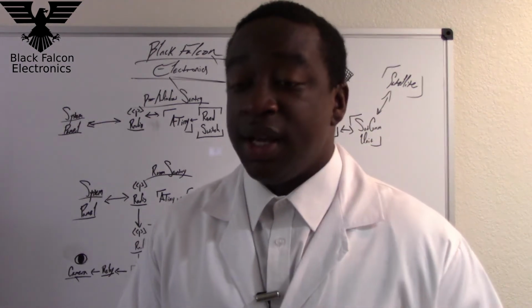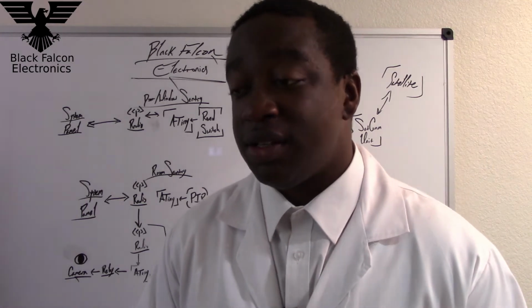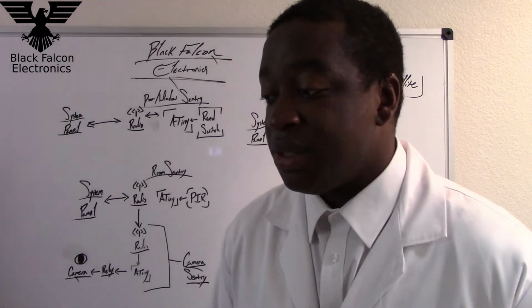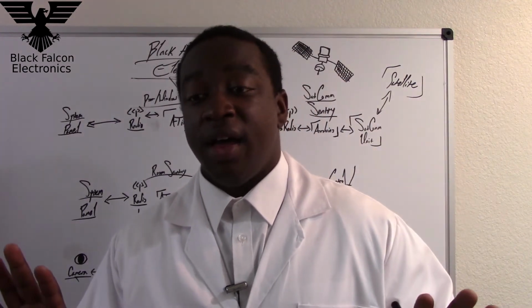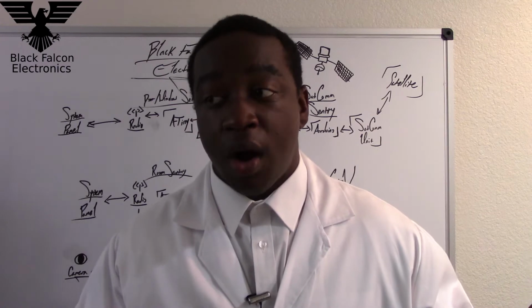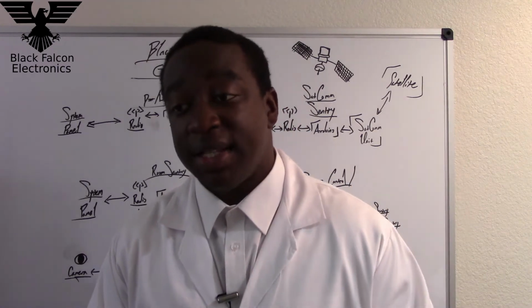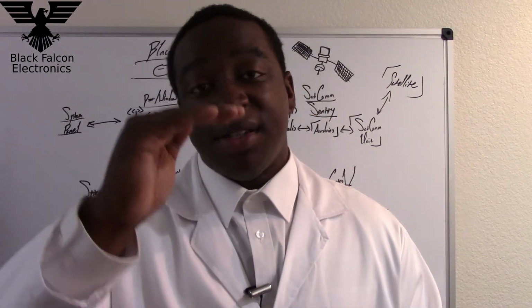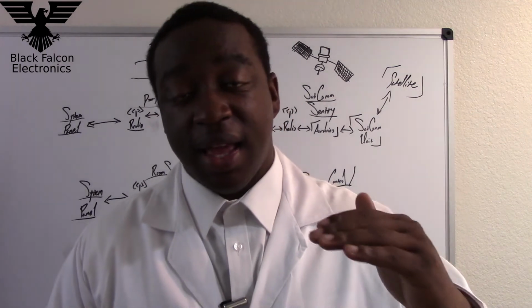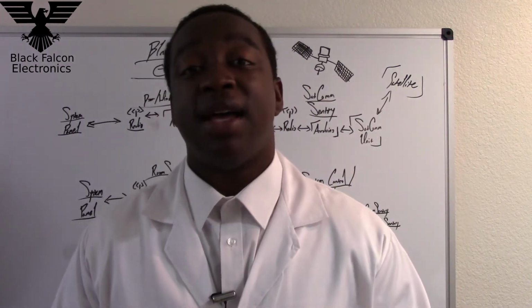When you first turn on a passive infrared sensor, it gets the steady state, the normal state of the area that it can watch, such as a room, for example. And once it gets its baseline, if it detects anything outside of its baseline, something that has more heat than it previously had, it detects it and then sends a high signal.